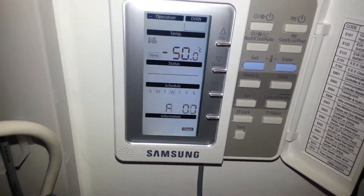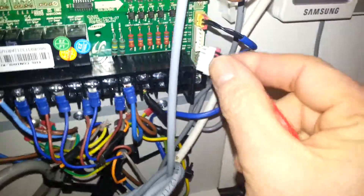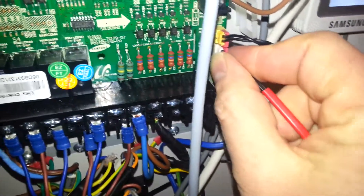E903 is very simple. All it means is that the sensor here — the red one — which is connected to the outlet of the backup boiler, has got to be plugged into the plug on the corner of the PCB here.